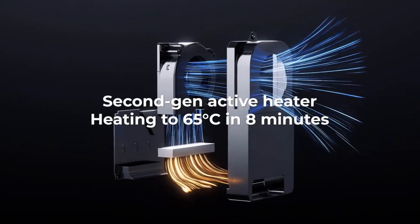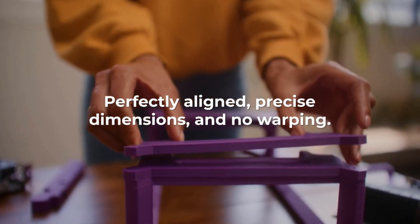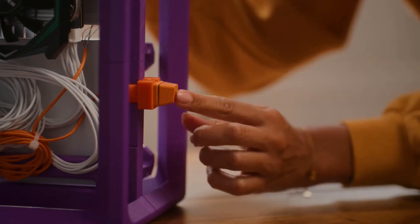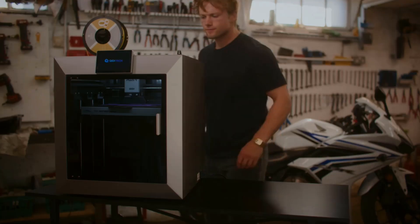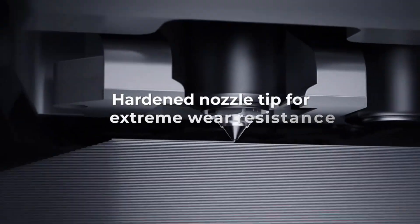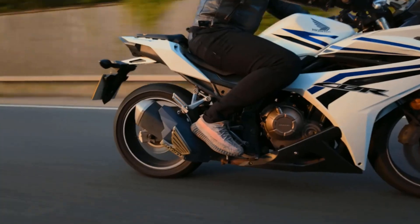Unbox to print in 10 minutes. Remote printing and real-time progress tracking are always available through the Qidi Mobile App or Qidi Studio Slicer. The X Plus 4 is also equipped with an HD camera for real-time remote monitoring and time-lapse photography. Filament runout and break detection features reduce filament waste and make it easy to achieve total intelligent control, ensuring a safer, more efficient, and convenient experience. The Plus 4 features an independent dual-motor driven Z-axis, a 6mm thick aluminium hotbed platform, and upgraded linear shafts and lead screws to 10mm diameter, increasing the strength and flatness of the printer for high precision and quality printing.